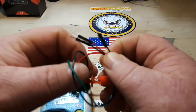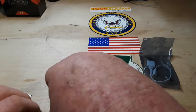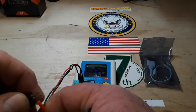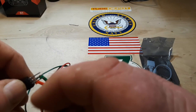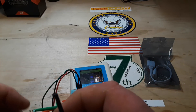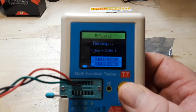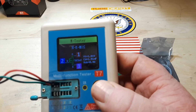It comes with a few accessories like these nice little mini grabbers. You can insert them into the ZIF socket, and if you have a component whose legs might be too big to fit in the ZIF socket, you can use those. Generally you don't want to check things still attached to a PCB because anything else it's attached to will affect the reading — if you have to, unsolder one leg. Interestingly, these wires changed our RDS-on reading, which is worth noting.